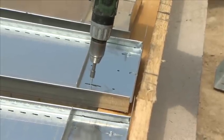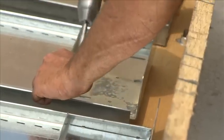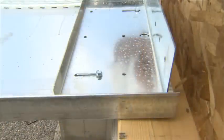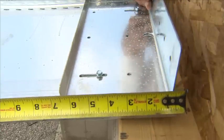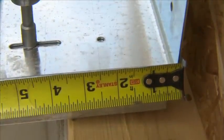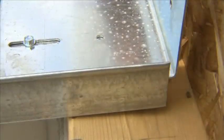Align the connector flush with the end of the joist and start two screws in the slotted holes using the number 12, 1-inch self-tapping screws provided. Keep the screws to the ends of the slots at the flush end — this will allow maximum joist movement later. Total joists' unique adjustable connectors give you plus or minus 1 to 1.5 inches of tolerance to meet varying site conditions. As the joists come with a 3/8 inch clearance at the ends, extend the connector approximately 3/8 inch past the joist and snug tighten. Do not over-tighten, as you want to be able to move the connector later if needed.